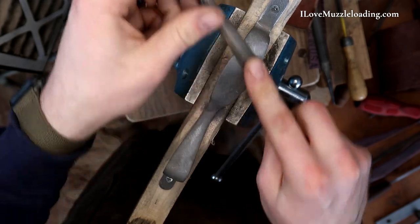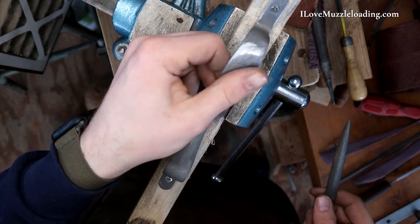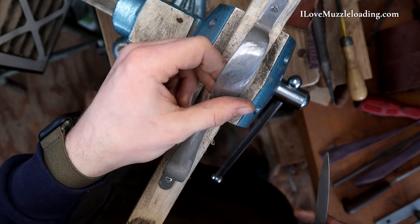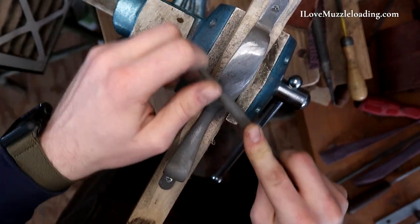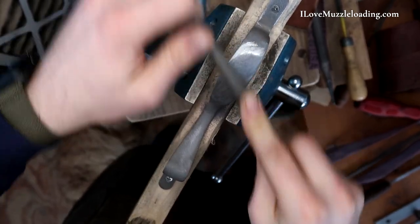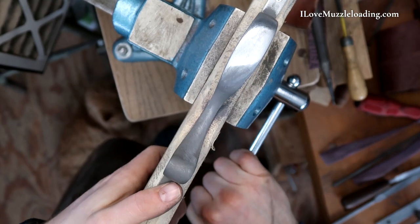When it comes to trigger guards, you'll find it helps to work with a half-round file because you can switch really easily from a concave to a convex surface. I can see that the casting surface goes in quite a ways, but that's okay. I'm going to switch over to a fine half-round file and get to work. Looking at the originals on these trigger guards, they're always smooth and round all the way through. So as I'm working, I'm going to think about moving around the guard a lot to fight any tendency I might have to naturally put in a flat somewhere.